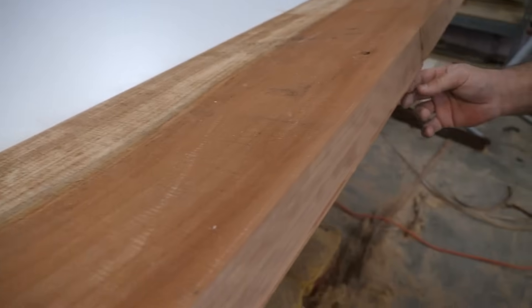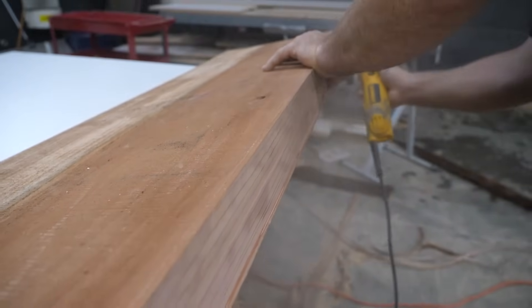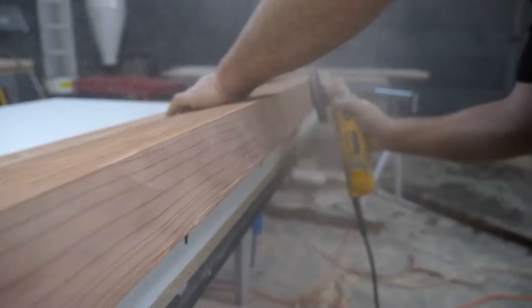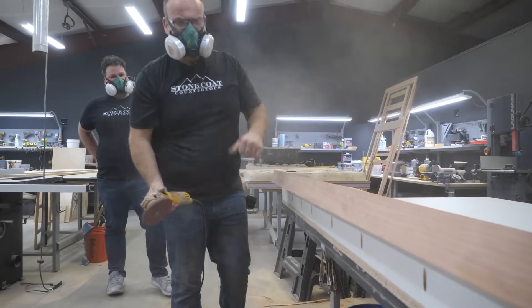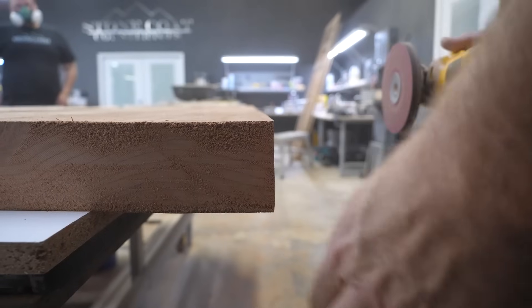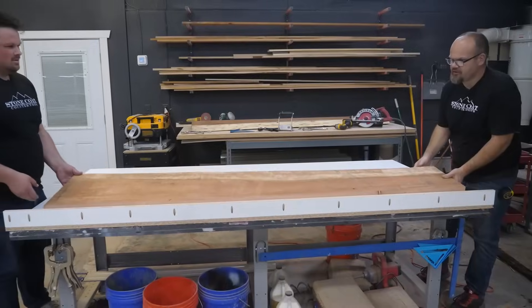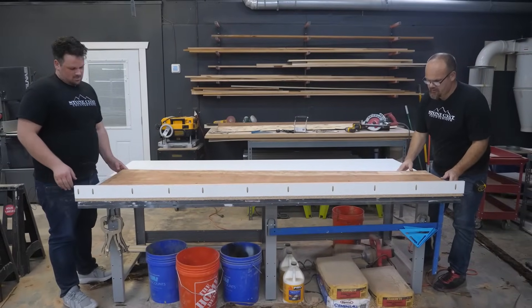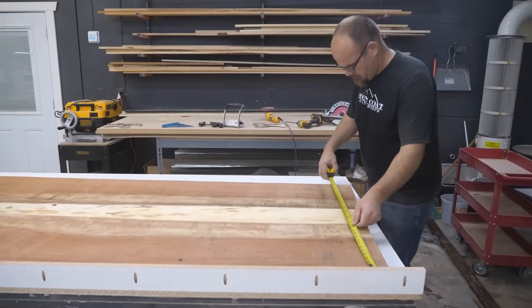See this high point from snapping it off? We're just going to remove that real quick. I have a little nub left over from snapping the river table in half using my fulcrum — the 50-grit metal sanding disc makes short work of that removal. Now I'm going to take my river table and mock it up. Because I have a true side already screwed into place, I can measure off that and keep the rectangle perfect.